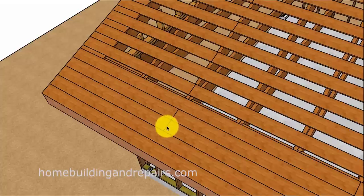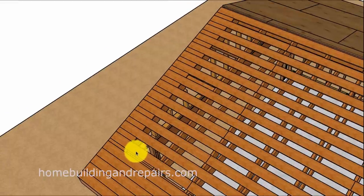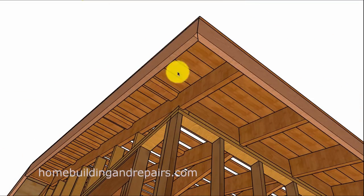It would be nice to have something a little farther apart if you were going to do this today. The spaced sheathing would also be used to help hold up the fascia board, so you might not even have lookouts. This model comes from a roof I'm using in a series about different roof designs for garages — two-car garages. This one has a lookout because I used plywood on the other side. In an older house, there often wouldn't be a lookout; the 1x6 would actually hold up the barge rafter for the fascia board.